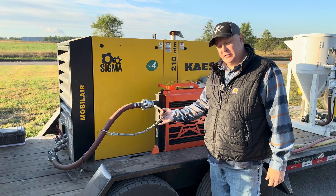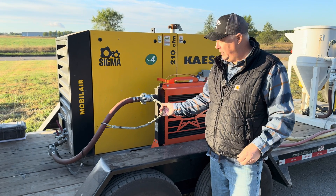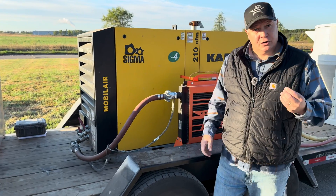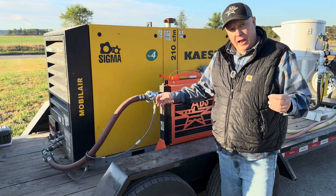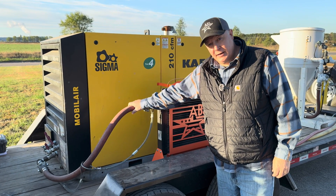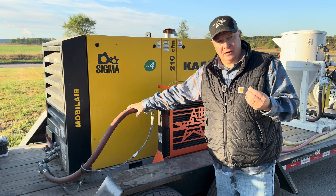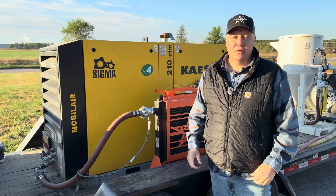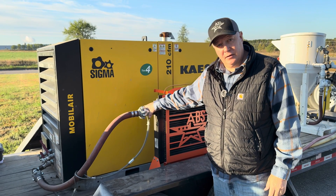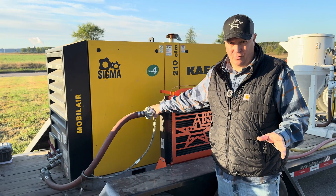You'll notice these whip checks — this is a 27 WC 15, a medium size. There's small, medium, and large size whip checks. These are super important for every connection — not only for your safety but it's the law. I almost lost an eye one time. I took a hose off that had pressure under it with no whip check. It came up live, smacked my hat right off my head, shot oil in my eye. I couldn't see for an hour — I thought I was going to lose my eye. Incredibly scary. I do not run or recommend running a system without whip checks. Super cheap, they last forever. Please use them.